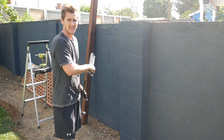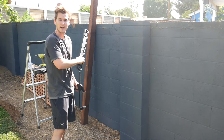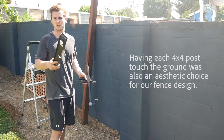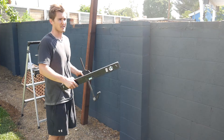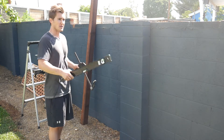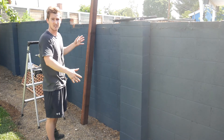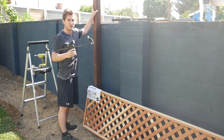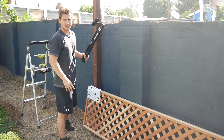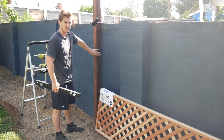Let me quickly go through the process of how I'm setting each of these posts. These are pressure treated four by fours rated for ground contact, so I can just mount them on the ground and flush up against the wall without worrying about fungus or rot. Just make sure you buy pressure treated lumber if you're doing something like this and the posts will touch the ground. When I go to mount the posts I do them one at a time: I roughly put it in place, grab my lattice and move it into position to make sure everything lines up perfectly, then temporarily use a squeeze clamp to hold it and check for level.